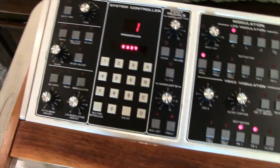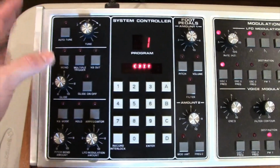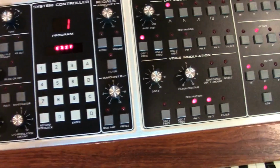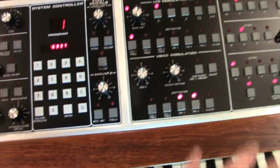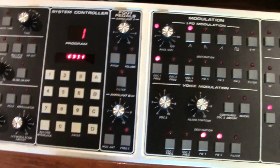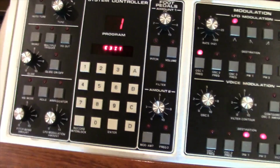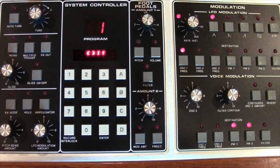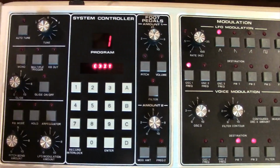Like I say, they all use auto-tune. They all have basically the same kind of architecture. It's just there's some things updated as far as time bases, some capacitor changes, and then some analog referencing changed to digital referencing, just to make this thing more accurate in its calibration of the voices when you hit auto-tune.